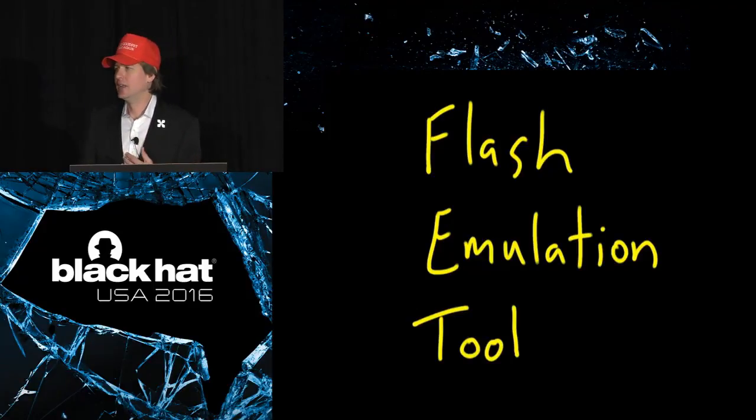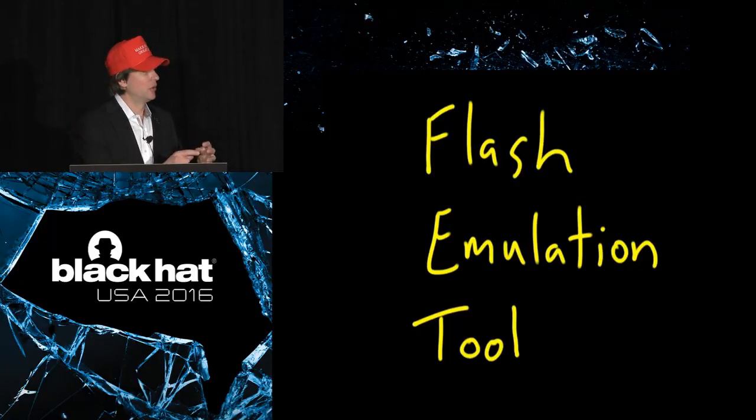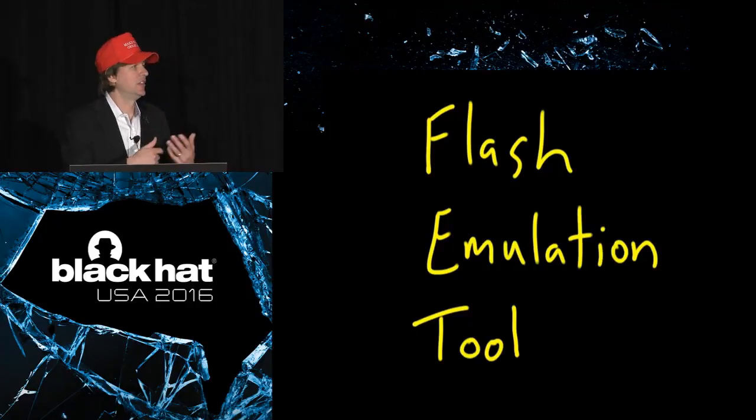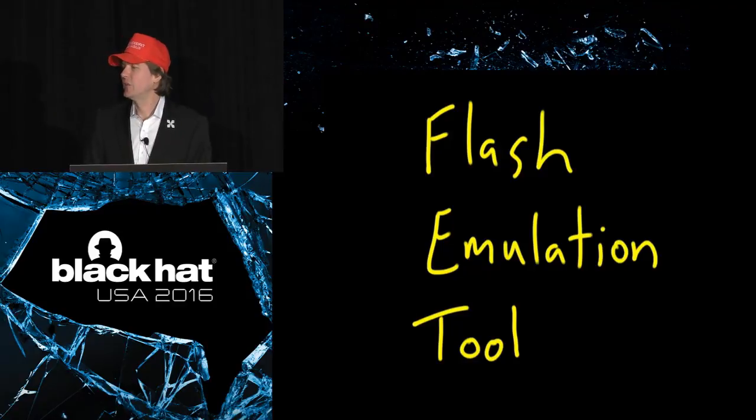The idea is, and this technique goes back at least to the 80s, that you have some kind of a microcontroller or microprocessor, and how do you debug it? How do you single step through code and stuff like that? A popular technique in those days was to actually remove the external storage, the program storage, ROM or flash, and wire in a debugger which emulates that storage.